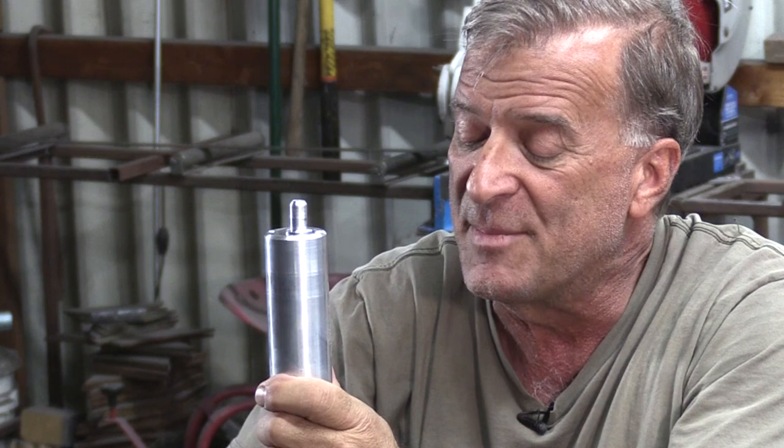So it's captive here in the bottom, but yet it still spins on the top. I turned the inside of this piece of pipe so it fits the outside diameter of that thrust bearing, and did the same at the top — turned the shaft down even farther so this smaller thrust bearing can fit in here. Then I turned a recess inside this top piece so it's a nice snug fit right over the top. Everything gets all lined up, all welded together, welded into the sculpture, and now everything can spin nice and smooth.